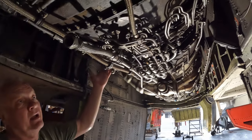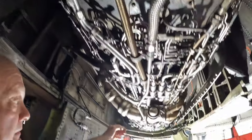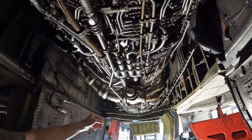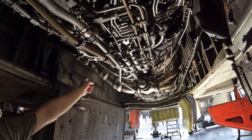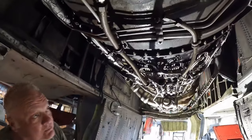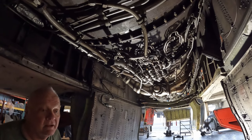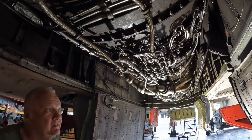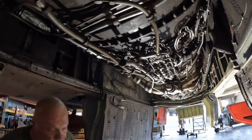That's the basic parts of the engine. These are the lower tangential mounts — there are five engine mounts total: the lower, the upper, the skate mount, side mount, and the main mount right up there. You can just barely see that little cone-shaped thing — that's the main mount. This engine weighs about 4,000 pounds but produces a lot more thrust than that. The thrust-to-weight ratio of the engine is pretty good, but once you stick it in a big heavy airplane like this, it goes down.